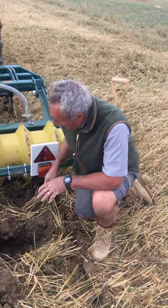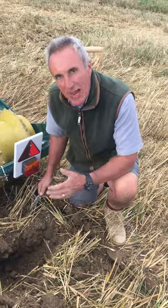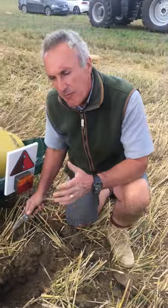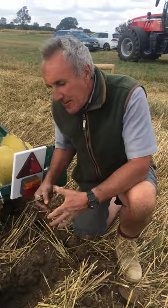What we've done really is first of all to check the effect of the pre-compaction that David's put in and anything else that's there. We've determined that we're going to need to work to get rid of all of it at about 20 centimetres, but what we don't want to do is boil the soil up and lose all the natural column support.